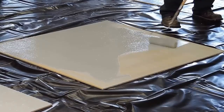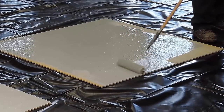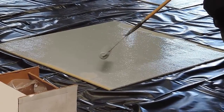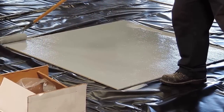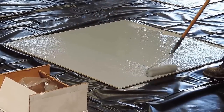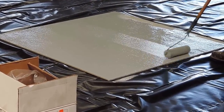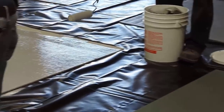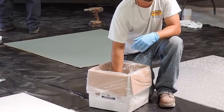That's not a good idea, because epoxy isn't UV stable. Epoxy is the same stuff they used to put that Chattahoochee stone in and mix it up. You know, a 50-pound bag, a gallon of pure epoxy. They slick up their trowels with xylene and trowel it out. Remember that? And then after a couple of years, it would amber and start popping off. Well, that's what happens to epoxy outside, right? They did it here, though, because the chips will protect the epoxy.